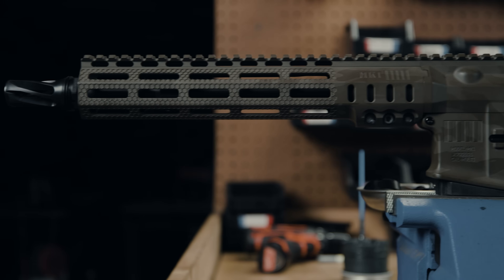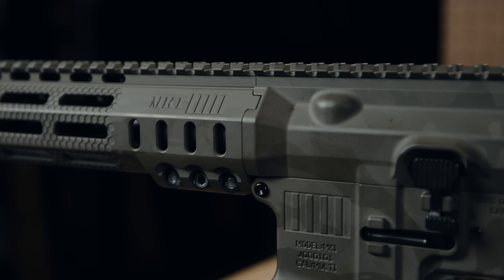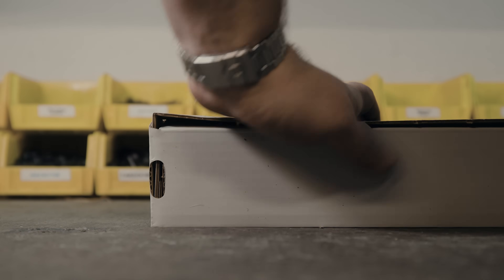The guys tracking what we're doing with our MOD and other exotic materials know we're having to go get the raw materials ourselves. When you have that level of control from the actual raw material to the finished product, you're able to have a very high degree of predictability of performance and a lot of control over consistency. There is a legitimate, material difference between a high-grade 416 and a low-grade 416. Starting out with a very high-grade stainless is going to be important to the longevity of the barrel, the machinability of it, and overall performance.